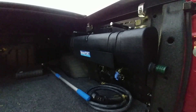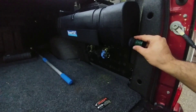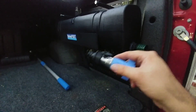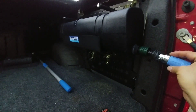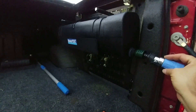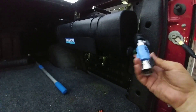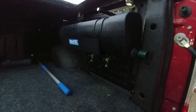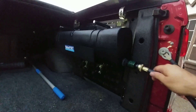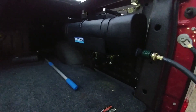Sorry if you hear the seagulls. If you want to see how this thing works, you essentially have a quick-release port on the side that also has a pressure release built into it. You take this quick-release valve, attach it to the end of your water hose, plug it into the Waterport, and turn on your water. It will automatically fill the Waterport and pressurize it at the same time. Once it reaches the correct pressure and water level, this will pop out and stop. You turn off the water supply, disconnect it, and your tank is ready to go. When you're ready to use it, you simply use the included hose and multi-sprayer, plug it into the Waterport, and you have water.